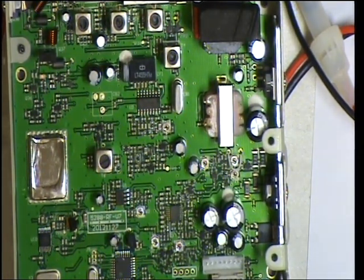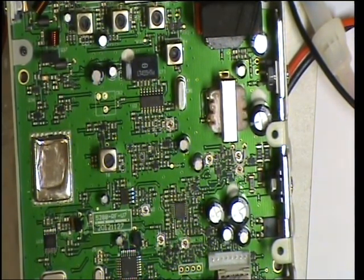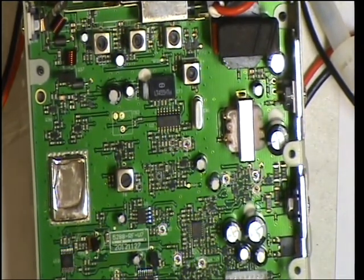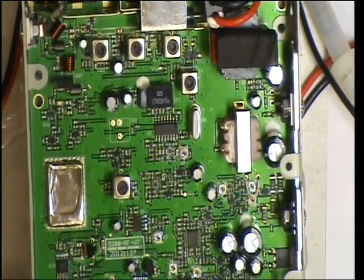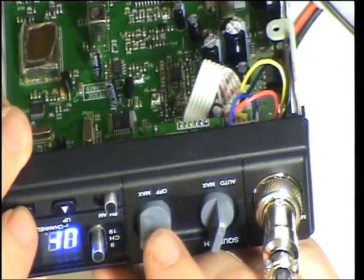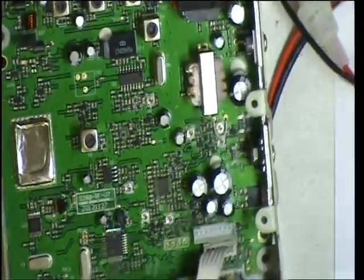So between W4 and W5 we've set up the AM modulation on channel 20 of the EU channels. We found out what W4 is — I'll write it on my crib sheet as AM gain. I may be wrong, but with no service manual and no circuit diagram this is what we have to work out. That covers the transmit section. Our customer is only interested in UK — I've done all that EU AM stuff just for the video. So we'll switch back to UK mode and go through the receiver.